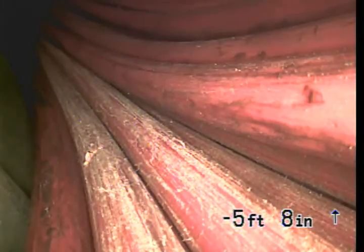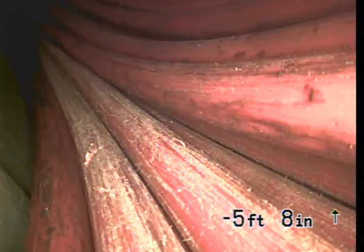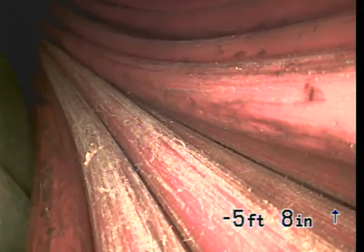The clay section where it joins the city main, which is the initial 75-foot mark, there is a joint there that's encased in concrete. That's what I was looking at for a moment, and it appears to be in good condition, even though there's concrete a little bit seeped into the inside diameter of the pipe. Other than that, clay pipe underneath the city street and sidewalk look to be good.